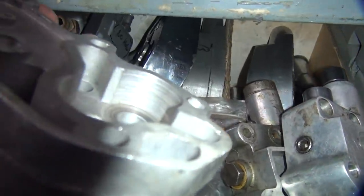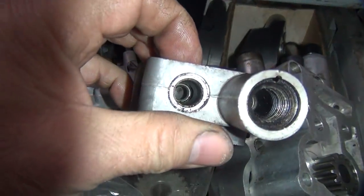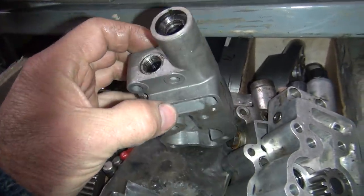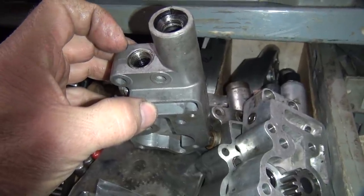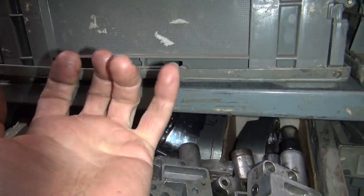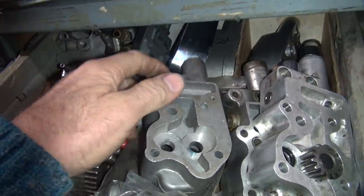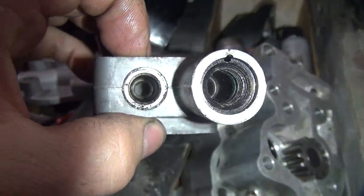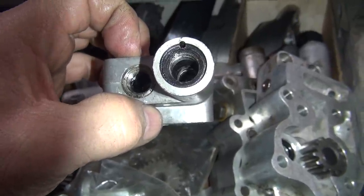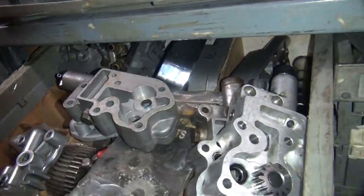I do this when I rebuild motors - I lap the seats in. After you lap the seat in, you have basically a bunch of lines going in a circle. Then I take another ball, put it in the pump and give it one or two taps with a steel hammer lightly. That takes the soft aluminum - it'll crush all the little line markings down, spread them out, and fit the ball so it gives a nice curve. Then I put a brand new ball in it and that easily stops the leakage issues. Look at the seat and make sure it's a nice gray seat all the way around when you're lapping. After you bang on the ball, it should be a shiny surface all the way around because the ball will burnish the surface - changes the metal so it's nice and smooth and fits the part.